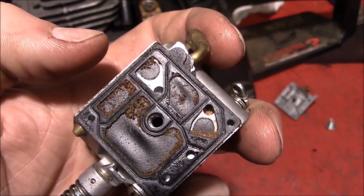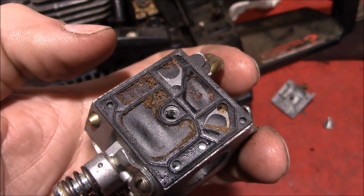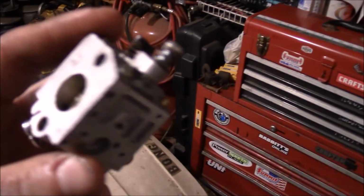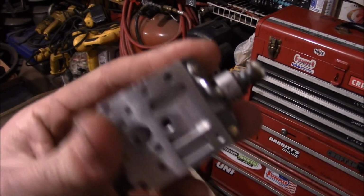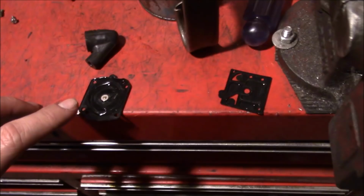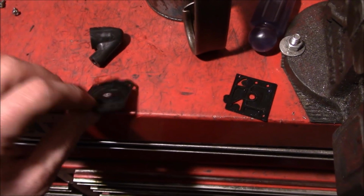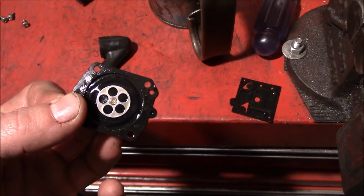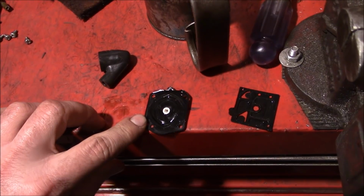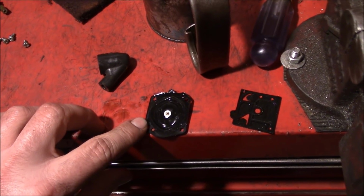Well, I don't think there's supposed to be that much sawdust in the carburetor. So while giving the carburetor its compressed air bath, we ended up blowing the little screen out of there. But we got lucky this time. We actually found it. That doesn't happen often. And another stroke of luck, the diaphragms actually seem to be fairly soft and pliable. We're just bathing them in some PB Blaster to try and revive them a bit more.